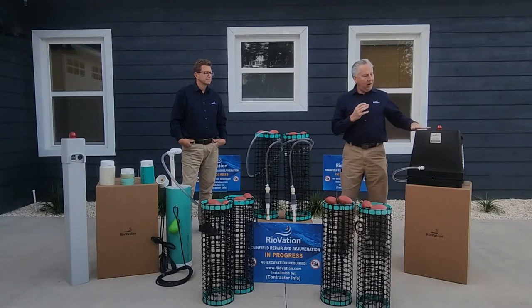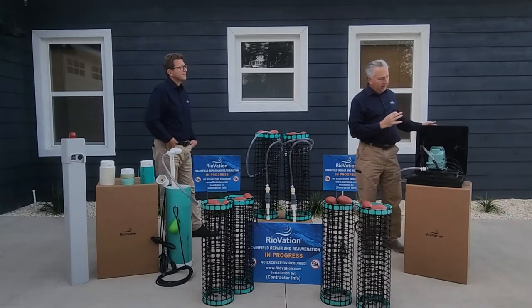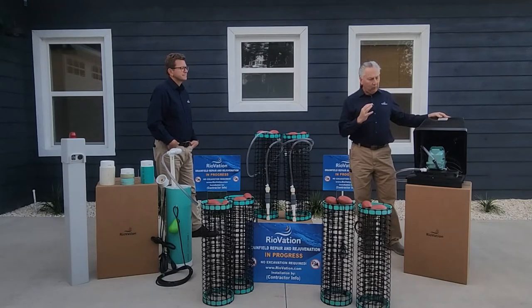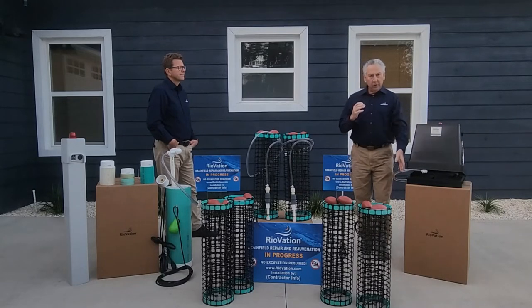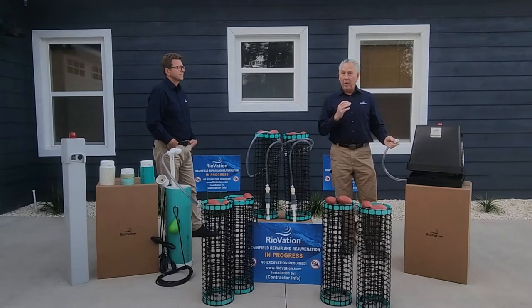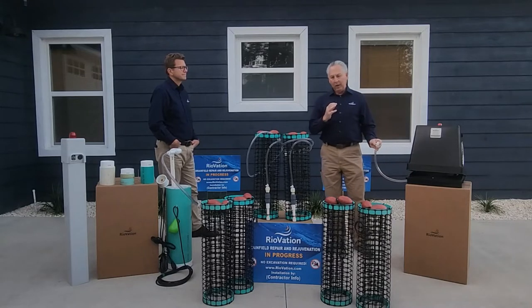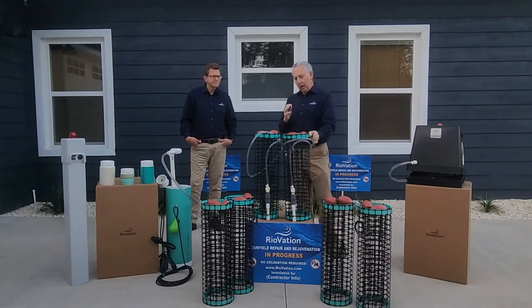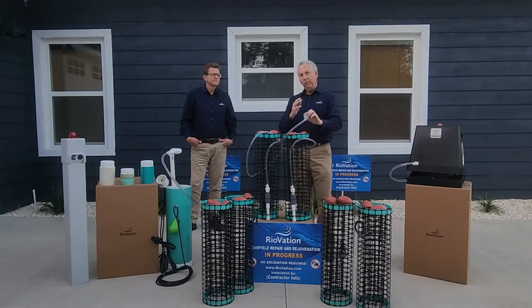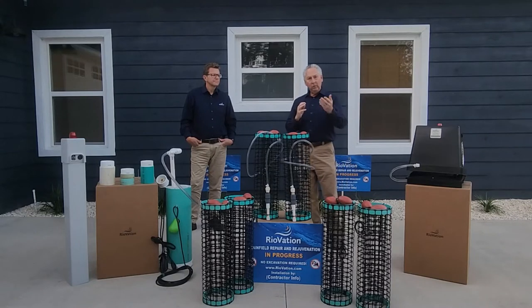The pods get lowered in and self-position. We have an air pump housing with visual and audible alarm. That alarm package is mounted to the inside of the lid, and we have the XP80 — the 80-liter high-blow pump — drawing less than one amp, very efficient, producing a tremendous amount of air. This housing can go near the house or an outbuilding, anywhere you have power, up to 75 feet from the riser. Then you run three-quarter PVC pipe, connect a female adapter to the barb fitting, and penetrate the riser.